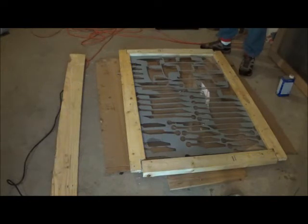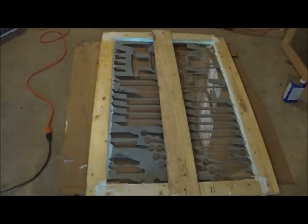I'm going to go ahead now and caulk this side, which is going to be the exterior, and put on this temporary reinforcing plank. With the bracing and scab plates, this is an assembly strong enough that I can confidently have the contractors lift it — they're going to brace it up further as they actually set it into the wall. My task is now basically done. I'm going to clean up some of this caulk, and from here on out it's up to them.